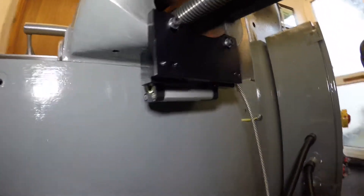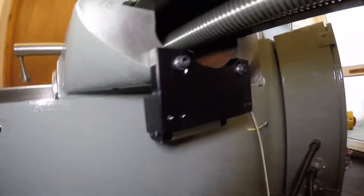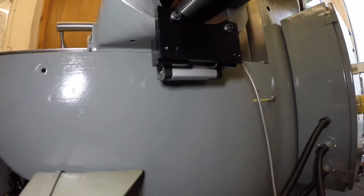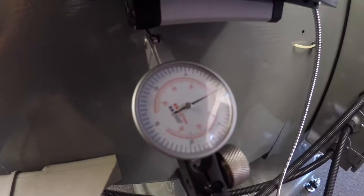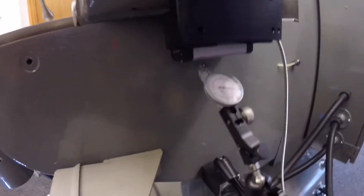We've got the saddle brackets mounted and the reader head on there. You've got the radius bracket with a spacer bar in between, then the reader head with the cable coming out of the rear. We'll get it within two thou now, so we'll get the dial indicator on there and get it squared up. We've got this side mounted and the indicator on there - we're on zero.